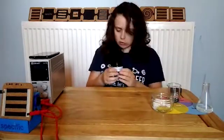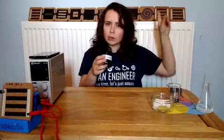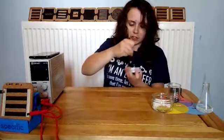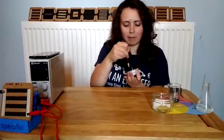Something to note is that inks, when you're printing with them for electronics, have quite interesting properties, similar to the ones you get on your wall, but to a greater degree. If I take this pot and hold it above my head, shockingly enough, my head is still very much clean. Whereas if I get a paintbrush and give this a little stir, the faster I stir it, the more easily the ink will flow, as it's something known as shear thinning. As I apply shear, the mixing, it will thin down, making it flow better.